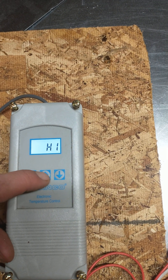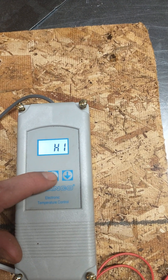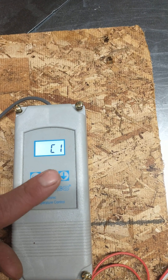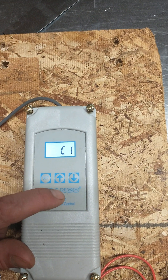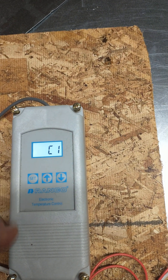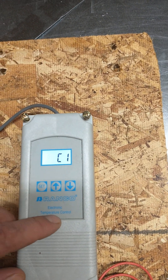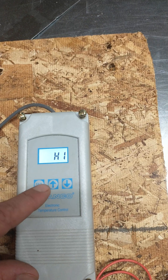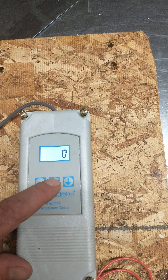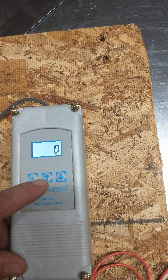Set again, there's an H1 and C1 option on this controller. H1 is if it's run as a heating system, which is what we're doing with the outdoor furnaces. C1 would be if you were using this control to operate something like a walk-in freezer — a cooling application that doesn't apply here. Just make sure you leave that on H1 so it cycles properly. The newer Ranco controllers also have an option for a compressor delay — just leave that at zero, it doesn't apply to what we're doing.